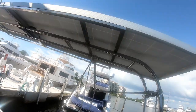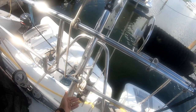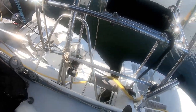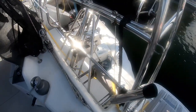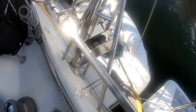As you can see, I got a line just holding it up more or less level, and I got some pressure holding it back here so the back end stays where I want it, and I got it sitting up against the back plate. But if you look, it's only sitting on the back plate on the top edge of it, so I could not do any welding the way it is right now.